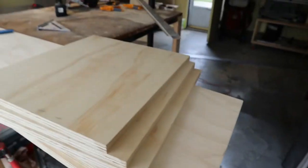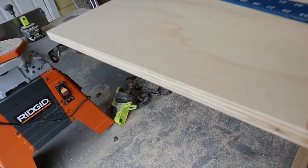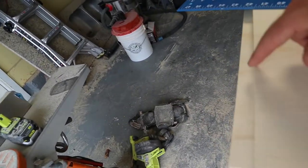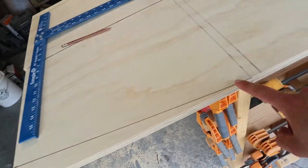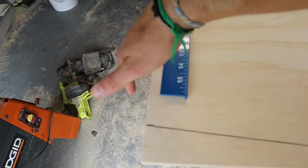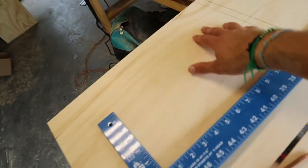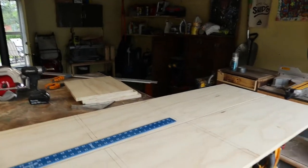We have our three shelves all cut up, but before I install these with pocket holes, I need to create a nice little diagonal because I want the top shelf to only be 12 inches deep so this doesn't look so boxy. Here's my diagonal line — 12 inches deep at the top right to the first shelf. I feel like it'll make it look a little more modern and won't look so boxy, especially since we're going to have a top shelf on this part anyway. Let's get these all cut and then we're going to put some pocket holes and assemble the carcass together.